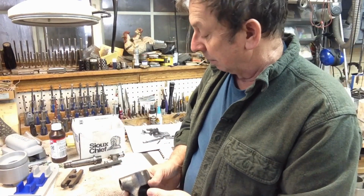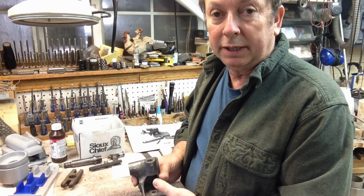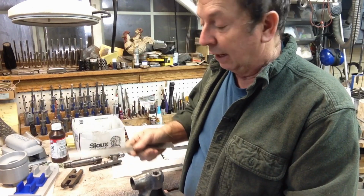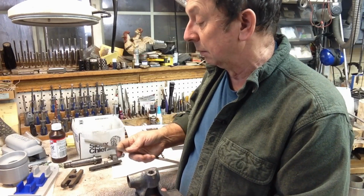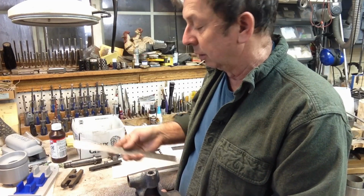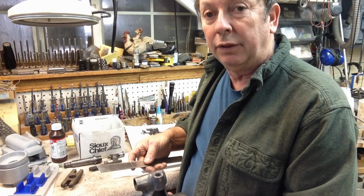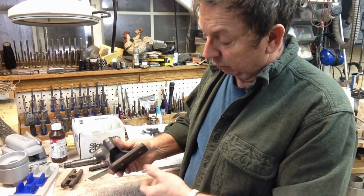Now, I'm going to cast these with aluminum shrinkage in mind, although I plan on casting these ultimately in cast iron. We're going to allow for a 3/16 shrinkage, which is what you would allow for aluminum. Casting in cast iron, you'll normally allow 1/8 of an inch, and I've got shrink rules for both of those. This happens to be a 3/16 shrink rule. So when we build our patterns, we build off of this ruler, and it has the shrinkage allowance already built into it.